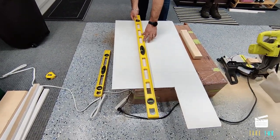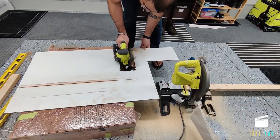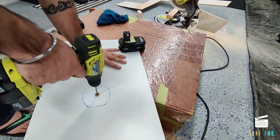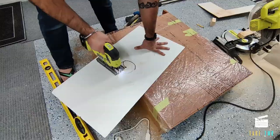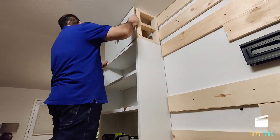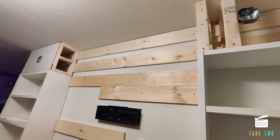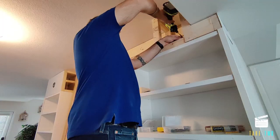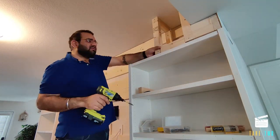To cover the frame we made on top, we used these white boards and measured and cut them to size using a circular saw. We also had to make holes — this was the first time Akshat was using the jigsaw, so it took some time, but we figured it out and got the holes in place for the light fixtures. We then attached it to the frame using brad nails. On the other side it was a little complicated because of a beam in between, so we had to make a smaller wooden frame to adjust for that, and we covered it again with the board.